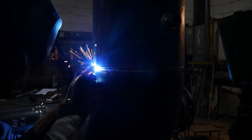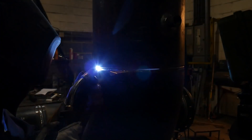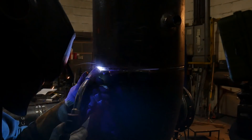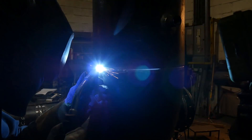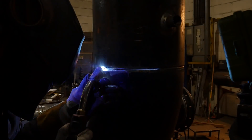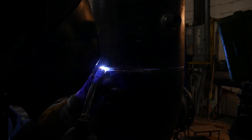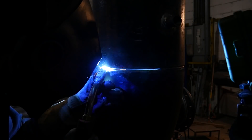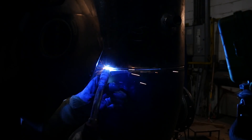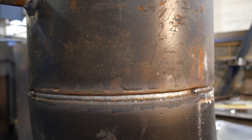A few tips I've learned: you want to prep both sides of your fitting and make sure you have no landing edge. That way, as soon as you see your keyhole opening up and closing, you know you're getting full penetration. If you've got a landing edge of 1 to 1.5mm you can't guarantee the root is pushing all the way through. Power is critical too — too low and you spend too much time putting heat in and stagnate in one position pumping in metal. Too hot and it's too fast, you just want to blow through and end up having to tack it, which you don't want.